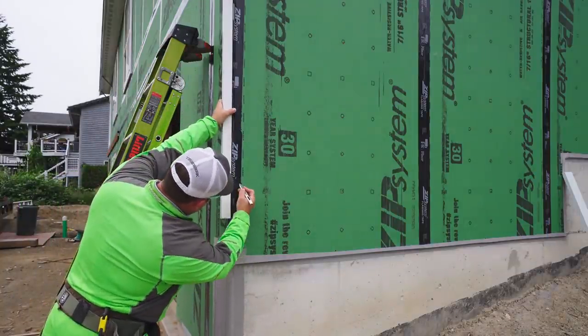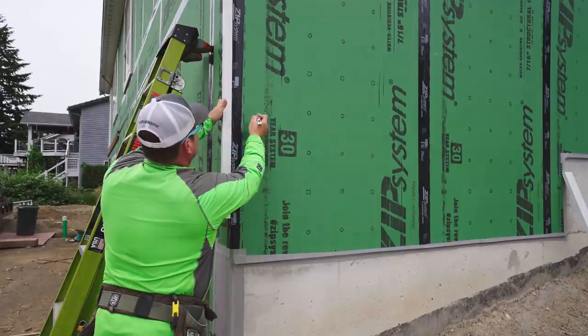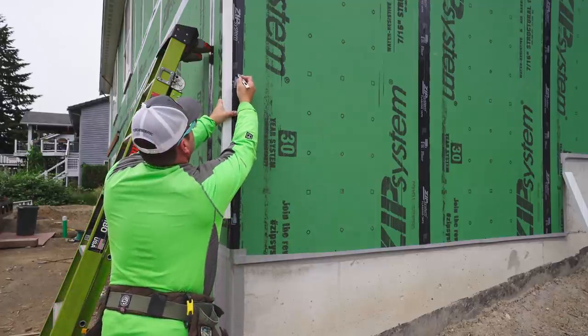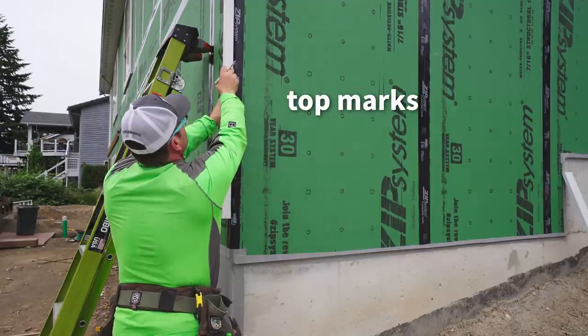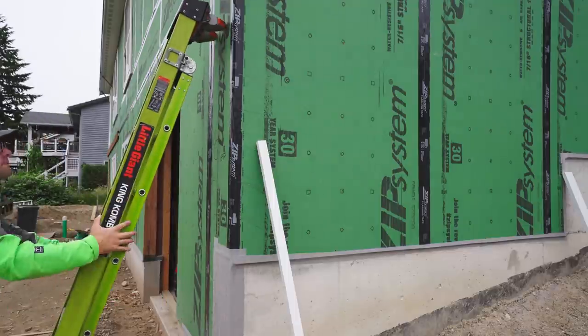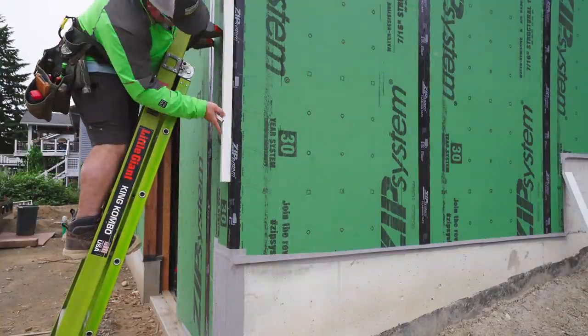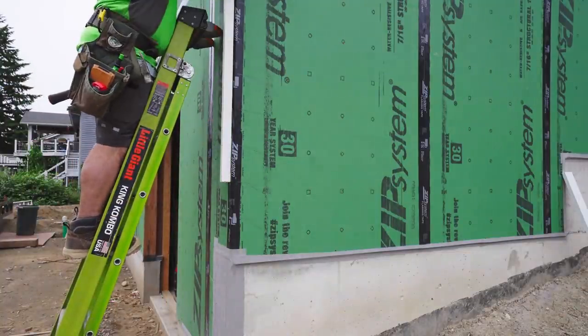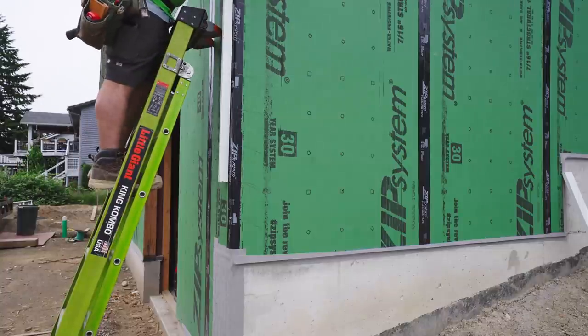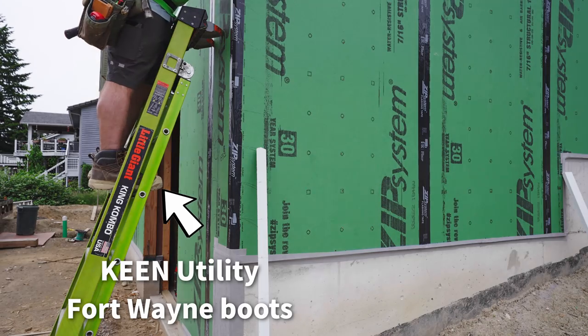Since I'm at this corner, I'm going to use my layout stick and mark around the corner. Then I measure from the mark closest to the laser mark. Whatever that distance is, I go to my other two marks and put a new mark representing the top of the siding. I keep marking my six and three-quarters increments until I get close to my control point, then out comes the tape measure.